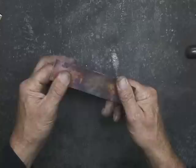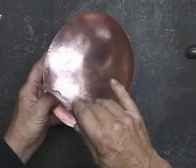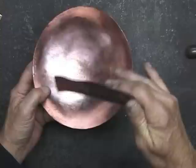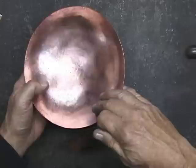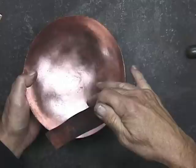And you can see just how soft this is — it's malleable. And this is particularly important if you're working with something like forming a copper bowl or some abstract shape. You get started, and after so many hammer strokes — I use a wooden mallet for this — but after so many mallet blows, the copper starts getting hard. Then I anneal it, go back to forming, and perhaps anneal it again, and go back to forming again. The point is that you can do this over and over again until you form the shape that you had envisioned.